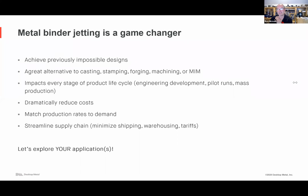Is it just a binder being deposited in between layers of the printed part? No. The idea is this: a thin layer, maybe 25, 50, 100 microns of powder, is spread. Then, imagine an inkjet printer spraying binder on that layer, just as if it were a sheet of paper, to decide what will be solid and what won't be. Then you go just like that. When you're ready to print the next part, you just need a little bit of powder without any binder in it. The powder is dense enough that you can print part on top of part. Then later you depowder and remove all the extra powder.